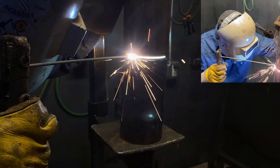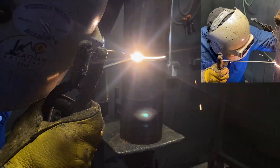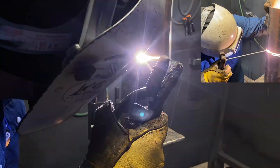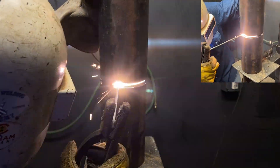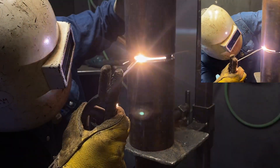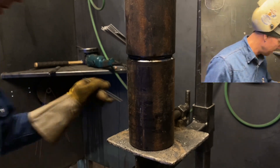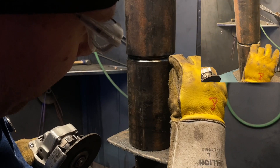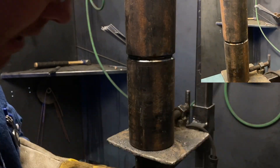Got it — that was a good tie-in. Now that weld, that gap is so nice, I overshot where I was going to stop a little bit because I just didn't want to quit. Now we'll run around that with a grinder, feather our tacks that are necessary. I always grind the start of my tack — I rarely grind the stop where the keyhole is because it tends to be pretty thin anyways, but I'll grind that start because that's always a real heavy spot.